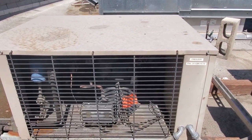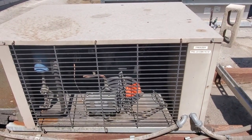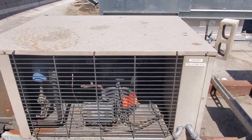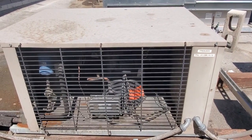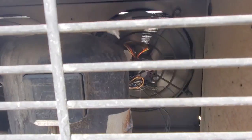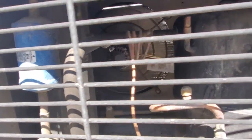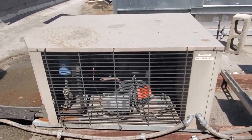The complaint today is that the walk-in freezer is turning on and off downstairs. They think it ranges from zero to 30 degrees and it's been doing it for about a day or so. I went down there — they have one evaporator fan motor that is bad — but there's not a massive amount of ice buildup and it's about 28 degrees in the box right now. Up on the roof, the compressor is not running. The condenser fan motor on the left is running but doesn't seem like it's going fast enough, and the one on the right is barely running.